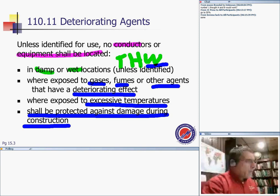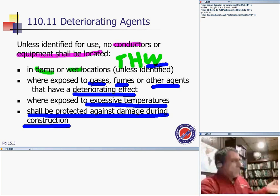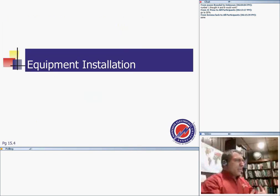Switchgear, a 4,000 amp switchgear. They unload that switchgear at the job site. You can't just leave the switchgear, if it's an indoor switchgear, outside, sitting exposed to the elements in Minnesota for 4 months until you guys wrap the building in and go put in your switchgear. You're supposed to protect it during construction. So if it's indoor-use switchgear, you're supposed to put it indoors, protected from the elements. During construction and, of course, after construction, that goes without discussion.